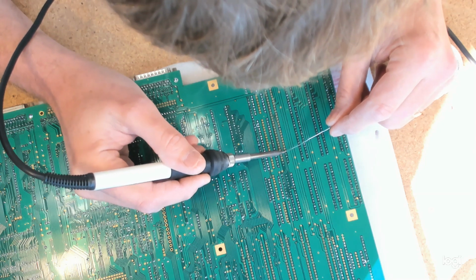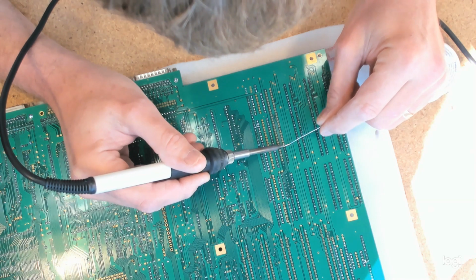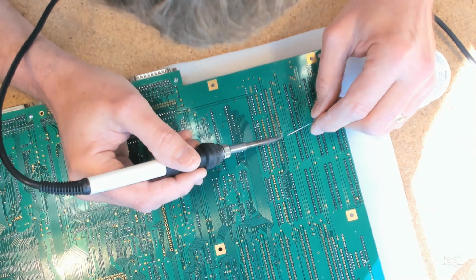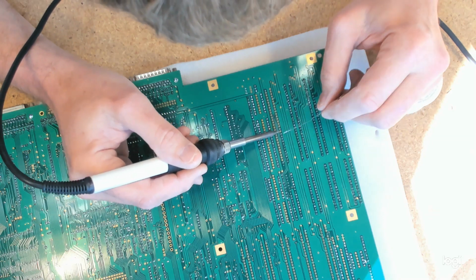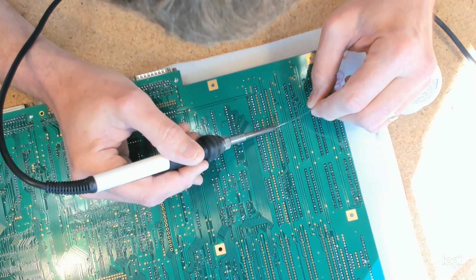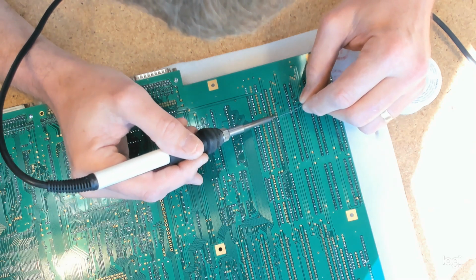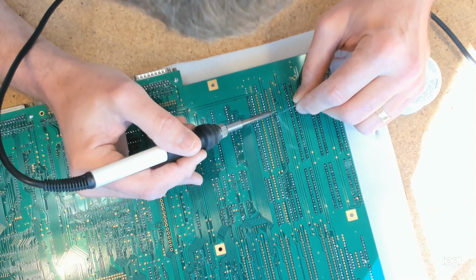You can see the solder is sort of dancing around there. It's because I've got too much stick out. Like TIG welding with too much stick out. Well, you kind of need it with TIG welding because it's so freaking hot. But it sort of doesn't matter. I found I can kind of wave it around and it just has to kiss the iron and transfer some heat. It's wobbling as it passes across the pad a bit, distributes the flux nicely.